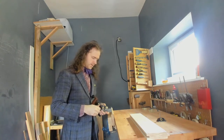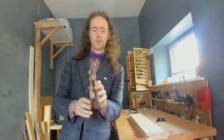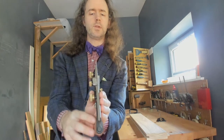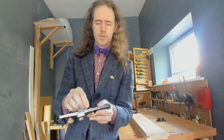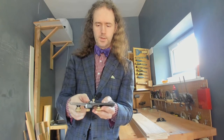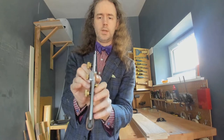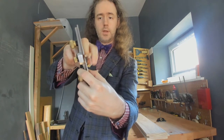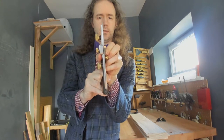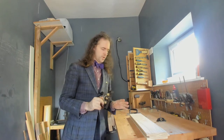The other possibility has nothing to do with the fence at all — it has to do with the blade itself. The blade is in solidly and absolutely flush to the outside edge of the fence. But if you push the blade in too far and tighten it up without thinking, you can end up with all the knobs perfectly tight but the plane blade slightly out of alignment. You can tighten that up and it will stay there, and the blade will gradually draw itself back in as you plane — at which point things go loose. So there are a couple of things to watch out for with the plough plane.